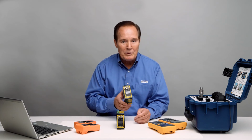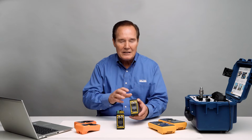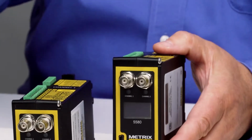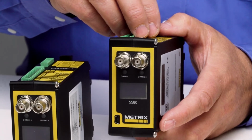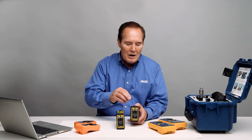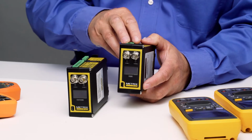Another reason why people use a signal conditioner is they can take the raw output, the acceleration signal or the velocity signal or the proximity signal, and they can convert it into a 4-to-20. And that's what this device does. So it not only powers the device, the sensor like an accelerometer, velocity sensor, or proximity probe, but it can also take that device's output and then put it out as a 4-to-20 that can go kilometers. So that's why people use a signal conditioner.